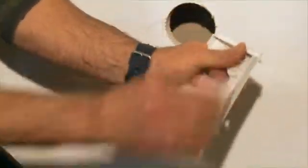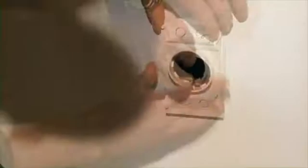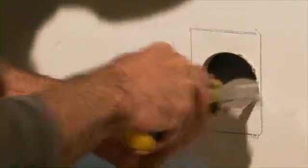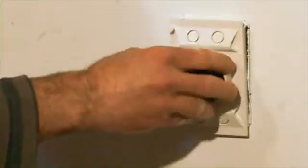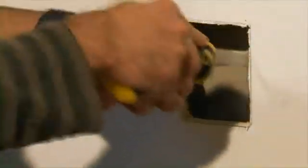In an existing home, use the mounting plate as a template. Cut its mounting tie and center against the socket hole. Level the inlet and outline. For a precise cut, hand saw the gypsum with a specialized blade inside your previously made marks. Rotate the mounting plate, insert it to see if it fits the contoured cut. If not, cut again.